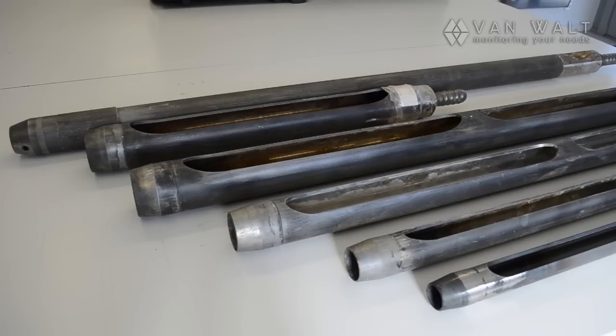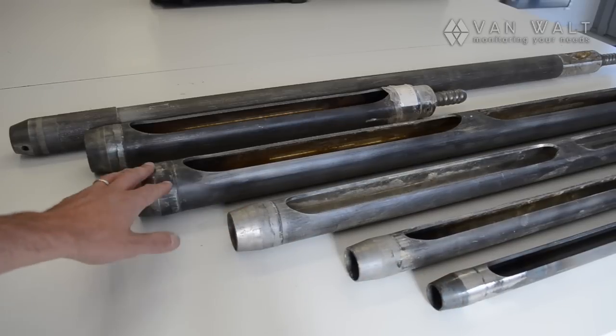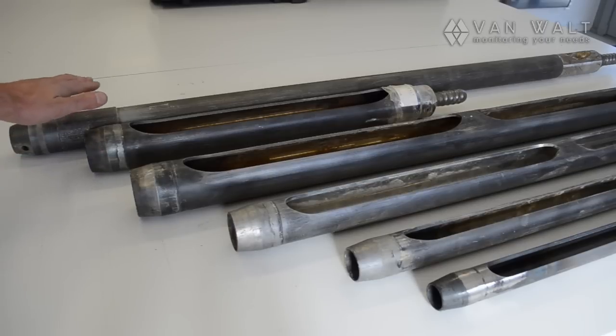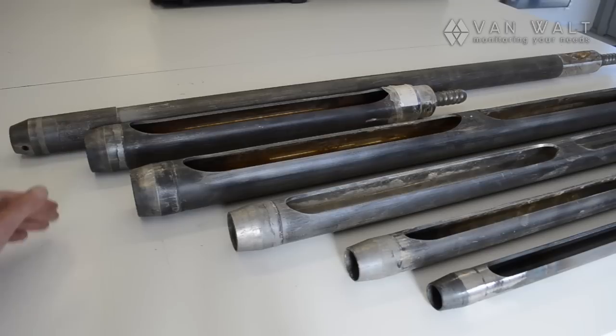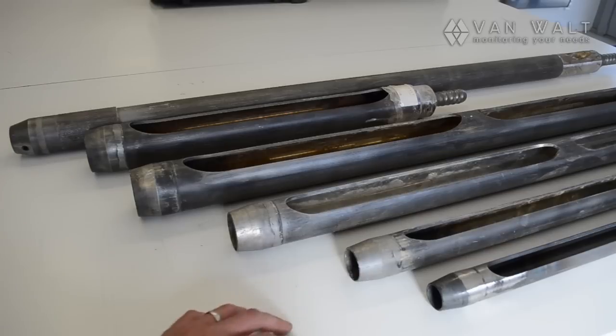Conditions on site were quite challenging. The sediment was a very fine compact silt, and so we used the full advantage of the stepwise system with the smaller gouges. As you know, we started with the little half meter. We took a core sample, a linered sample, at the 1.5 meter point, and then we progressed downwards, getting ever smaller to make our life a little bit easier as we moved down through the horizons.